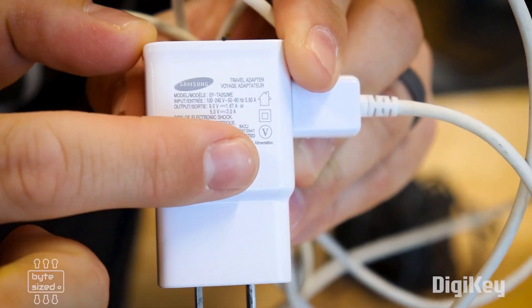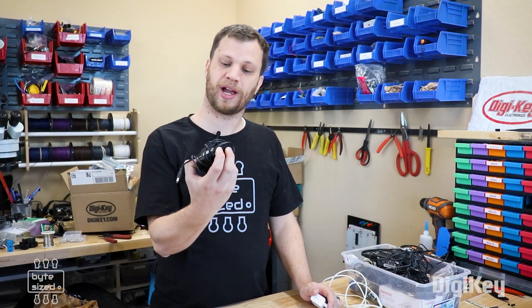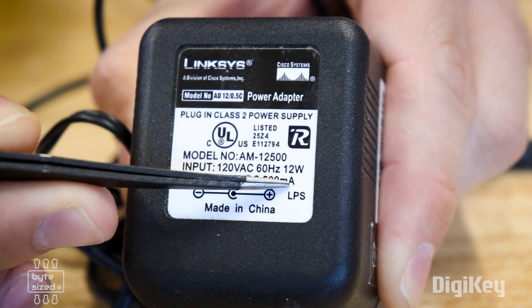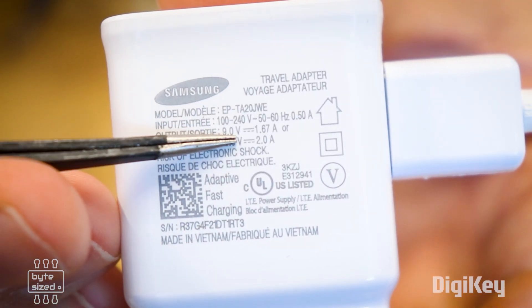The next option for powering your project is an AC power supply. These are sometimes called wall warts because they can be unsightly, but they are a great option for powering your project. We all have these lying around the house — this one I took from my old router, and this is actually an old cell phone charger. These power supplies have a voltage rating and a continuous current rating. They will deliver a constant voltage — 5 volts, 12 volts, or whatever they're rated for. The load will dictate how much current it needs, so be sure the discharge rating is at least as high as your project's current consumption. This old cell phone charger is rated up to 2 amps at 5 volts.